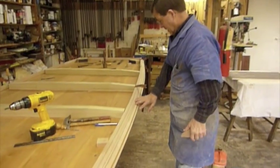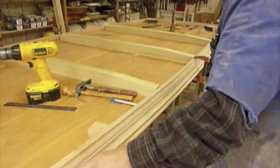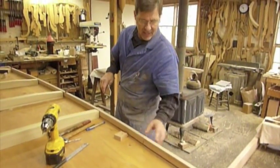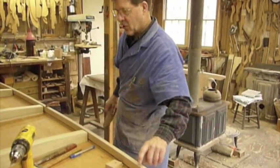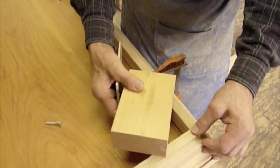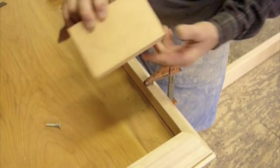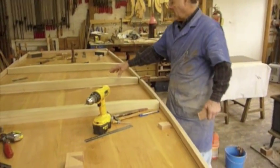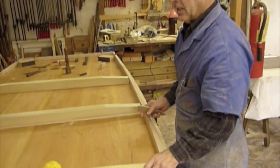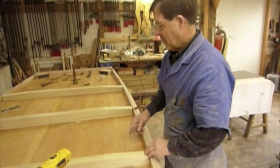At this point, I have fitted all the molding here, which you see. As I mentioned yesterday, I had to add on to these two central long sweeping sections to obtain the length that I needed via this sort of a blocking scarf joint. Then in these corners, I'll fit in a pretty substantial glue block that will help secure this joint here, which will only really be glued to the back side of this, of course, not to the underside of the table itself. Pretty major battens here in poplar — one in the middle, one on either side.